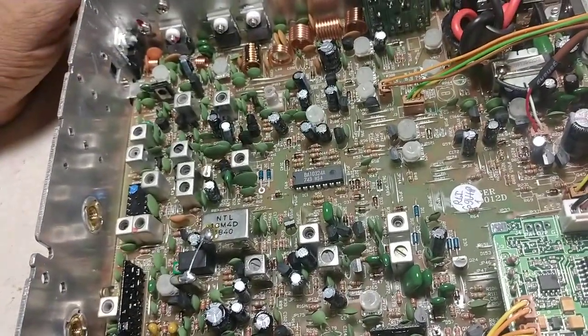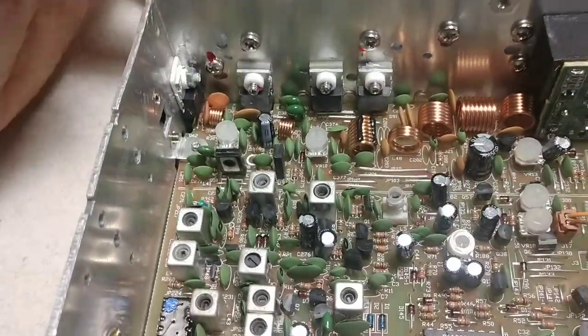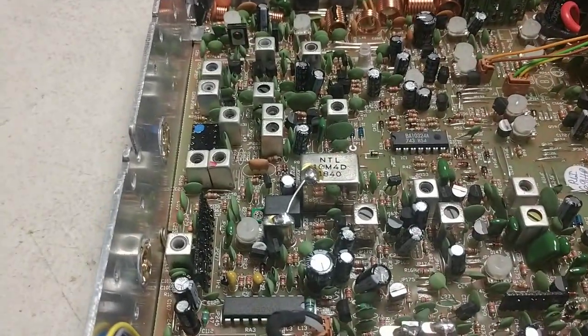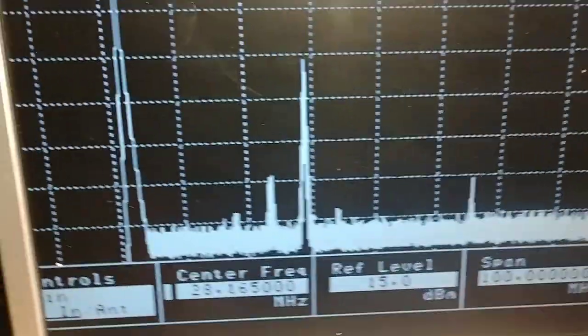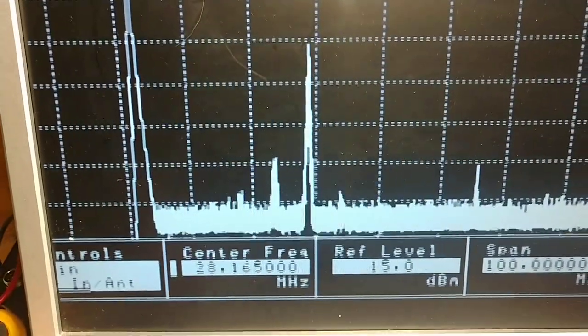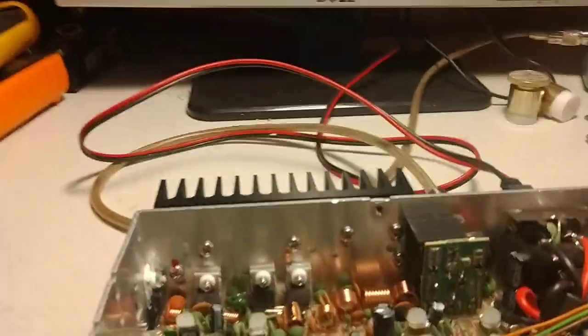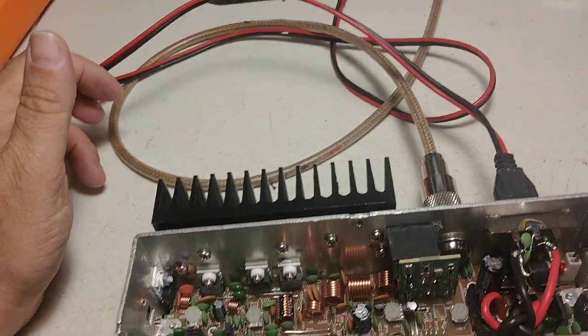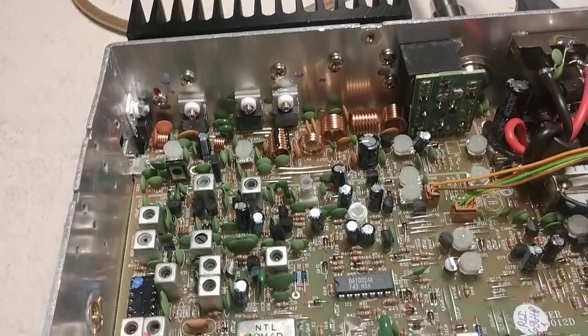There's still some tricks we do on the receive on our end. Radio looks pretty good — it's got a pretty beefy heat sink on it. We'll key it up here and we're still doing about 60 watts PEP. If you notice, we've got a little more trash on the display. Not quite 100% modulation — it's kind of rolling on us. We're going to get started on this and get her tuned up and ready to go and get this thing out to Terry.